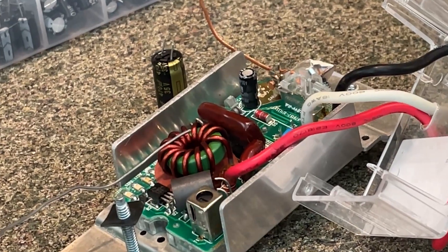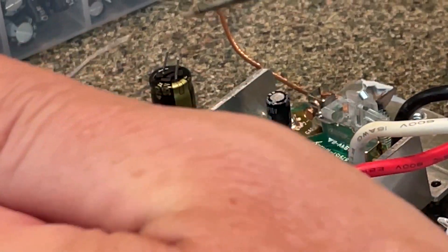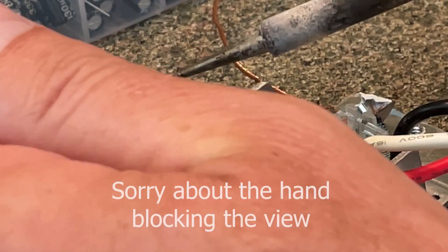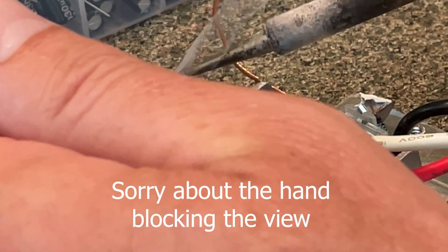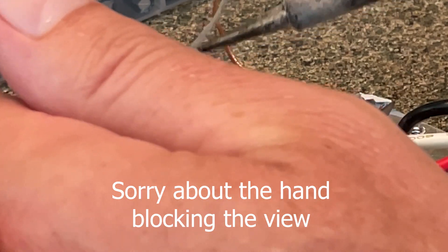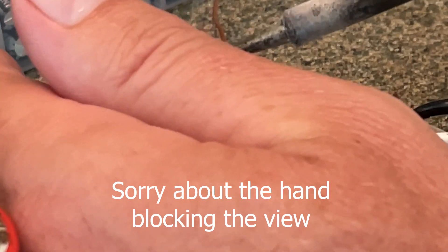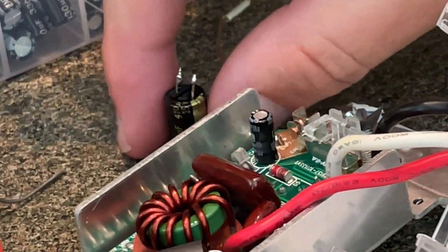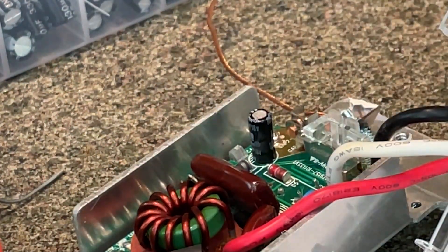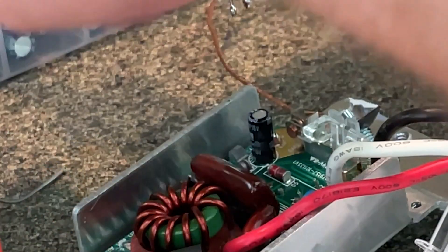Sometimes an easy way to do this — since we only have two hands — is to get some solder on one side of the leads, then melt it against the other ones and the solder will stick to both. So I'm going to goop a little extra solder on one side, then reach in and solder this to the leads on the board.